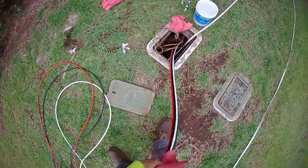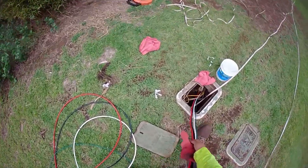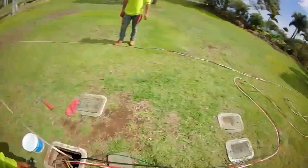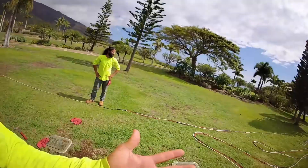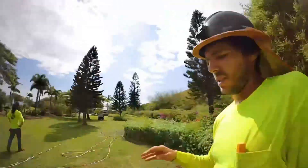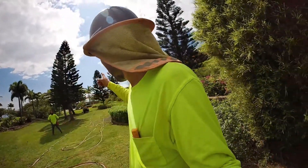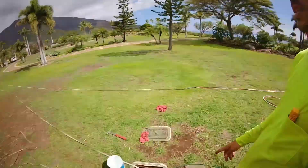When you're pulling wire, always use proper body mechanics or you'll really mess yourself up. So we're at the midpoint of our conduit. We've pulled the whole of this side out onto the grass. Now you may not always have the luxury of having a big field of grass — if it's on concrete or gravel, you might not want to drag the wire across it. In that case, you would pull out like 30 feet at a time and have another guy on the other end pulling more as you go so that you only have a bit of a loop at a time.